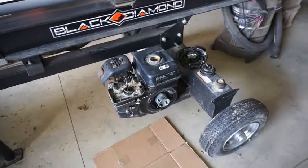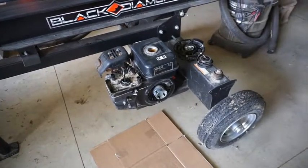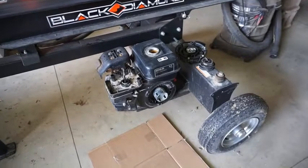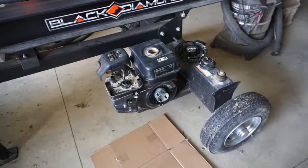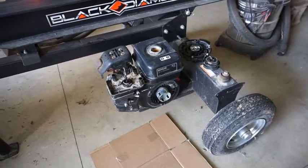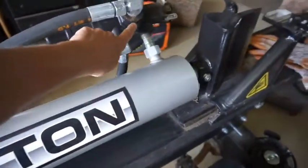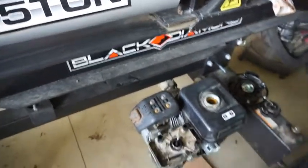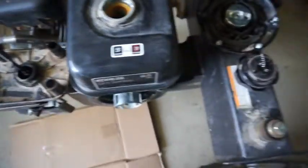Welcome to the Garden of Odin. Let me show you what I messed up. I left the log splitter down at the bottom of the field. It's August but the weather hasn't been too bad, so I was starting to split up a fallen oak tree. Two nights ago we got a deluge — probably five inches of rain. The water got up probably to here because that rust is new, and there were limbs and debris up in here. I pulled it out yesterday and brought it up to the shop. There's water in the gas, rust inside the gas cap, and mud inside where the filter was.